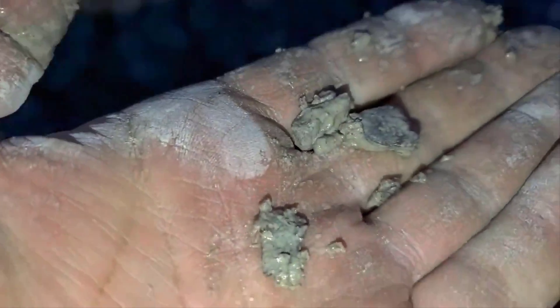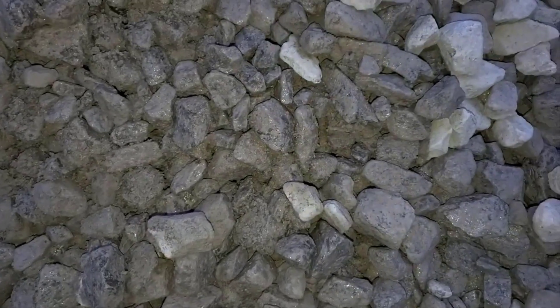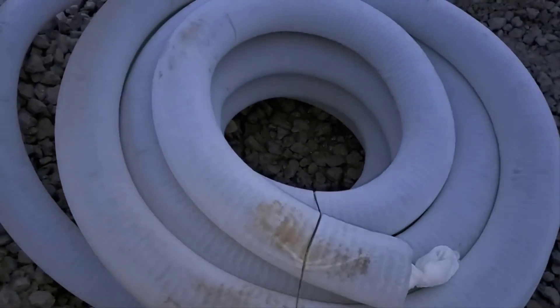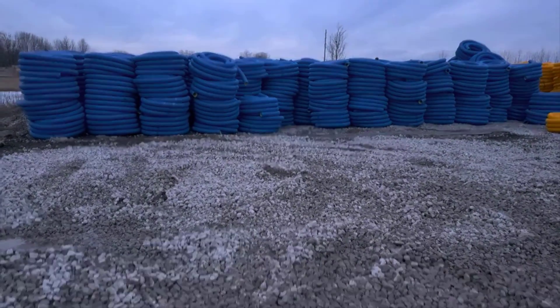Here's my concern: I'm not going to shun this product because it drains too damn good. A good crushed dense stone, inch and a half and up, really performs. But I do want to see people using the high octane with a sock — that over there is high octane without a sock.